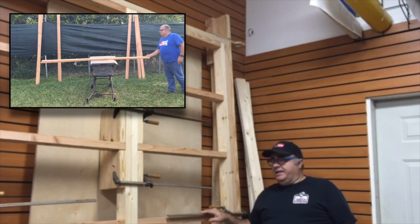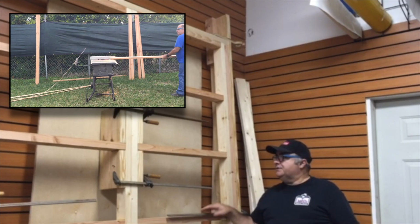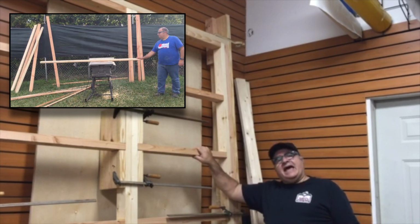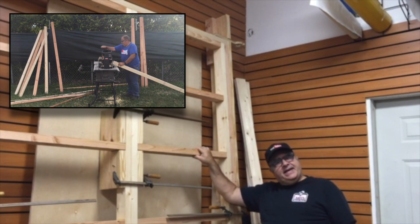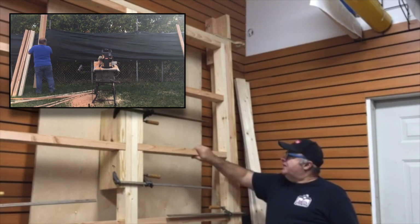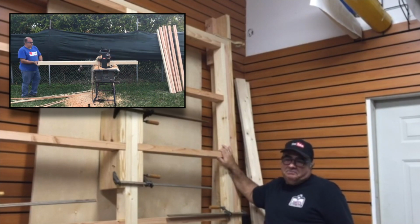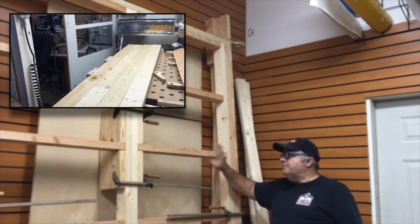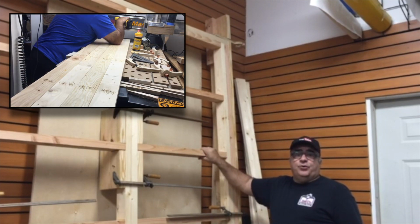The first thing that I did, but this is a personal preference, is shave off all the rounded corners, what Dave Gatton likes to refer to as deradii-ing the 2x4s into 2x3s. So you get some nice looking square pieces. It's up to you whether you want to go through the extra step of ripping them and then planing them, but I like a nice neat square board for my table.